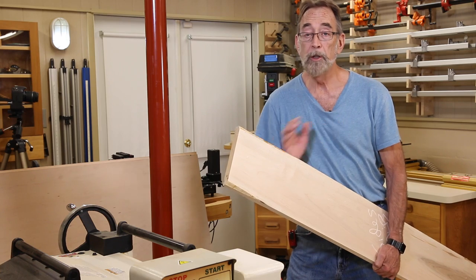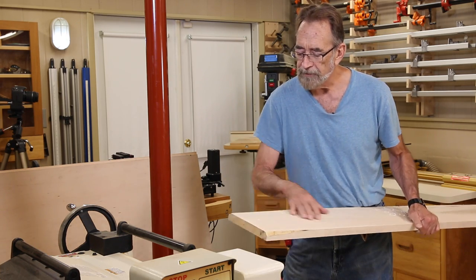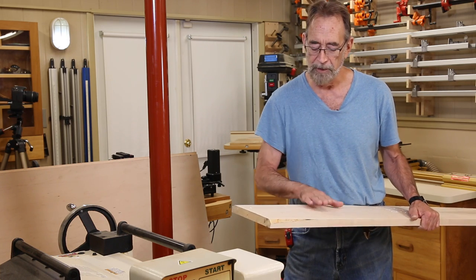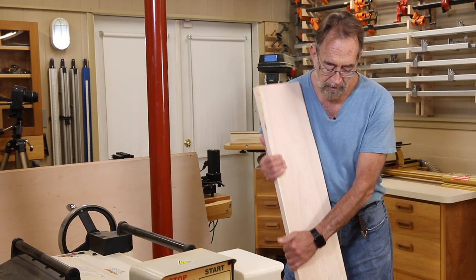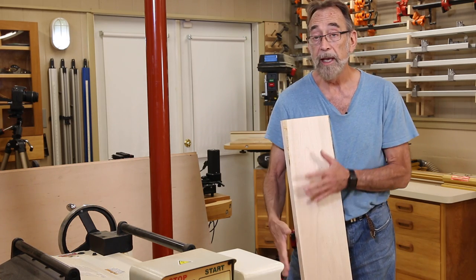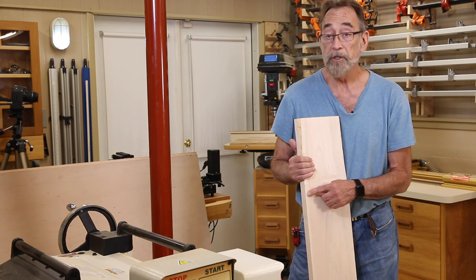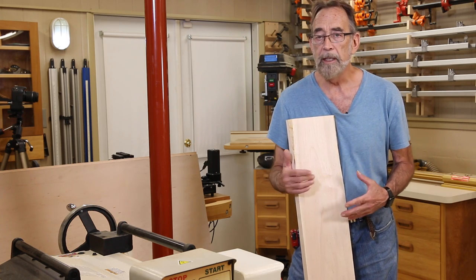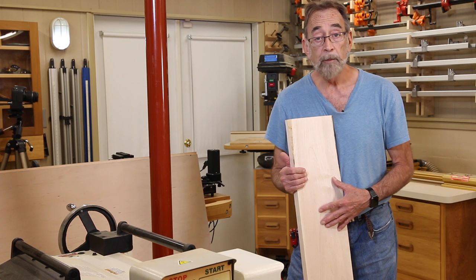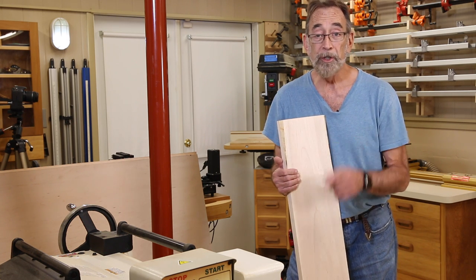So this is great. While that first glue up is setting up, I'm gonna go back to thickness planing. I figure I've gotta make about 3 more passes on these boards till I get them down to 3/4 inch thick. Then I'll joint 2 edges and edge glue all of the pairs up. And in the next video, we're gonna start cutting the dados and the rabbets. And because these boards are so big and so wide, I'm gonna cut them with a router using a guide rail as a straight edge. So be sure to come back for that.